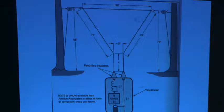The top of mine, I've had it anywhere from 45 feet to probably 60 feet. And I can tell very little difference in the results that I get with it. So you put it up very low compared to 130 feet. And it's basically feed the center of the coax to one side, come over down into the radial system with the other. And it really works super well.